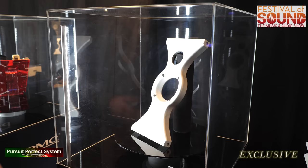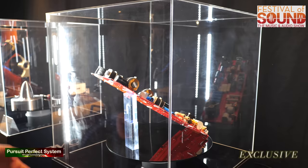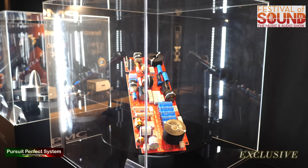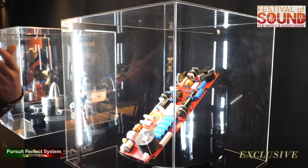Here we've got the crossover — it's by far and away the most advanced crossover we've ever developed. It's got provision for both LF and HF tilts, up and down. Over here there's a big bank of blue capacitors — over 2 millifarads of capacitors — which allows us to have LF boost and cut at below 80 hertz. So if you've got a bass-heavy room, you can turn the bass down; if you've got a very large room, you can turn the bass up a bit. It really lets you customise the speaker, and that's done mechanically in the crossover.